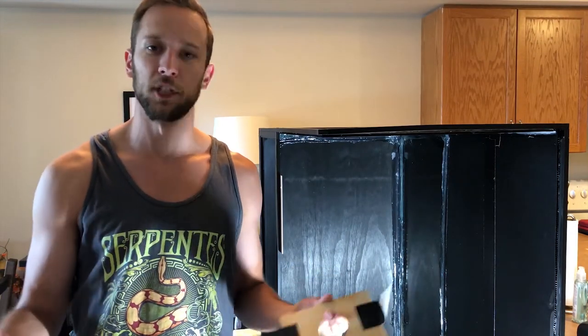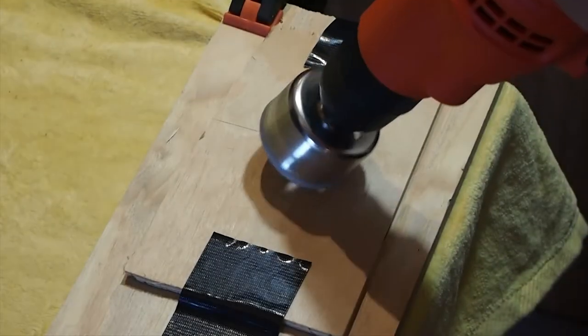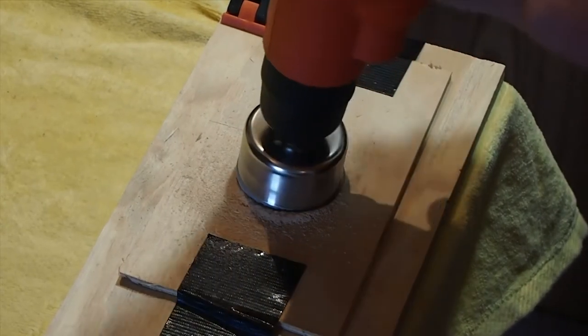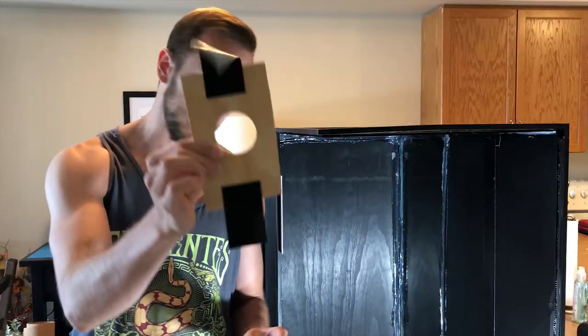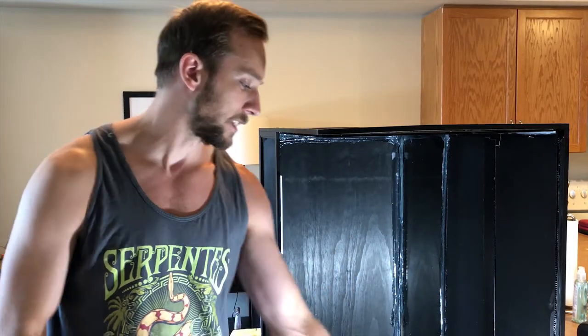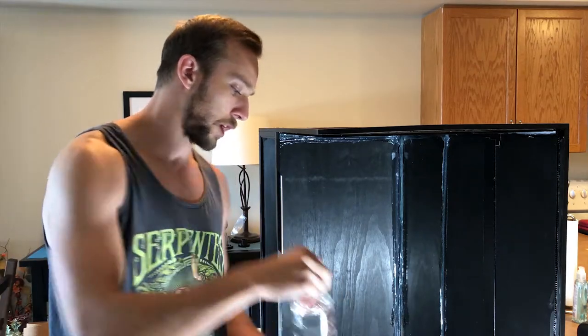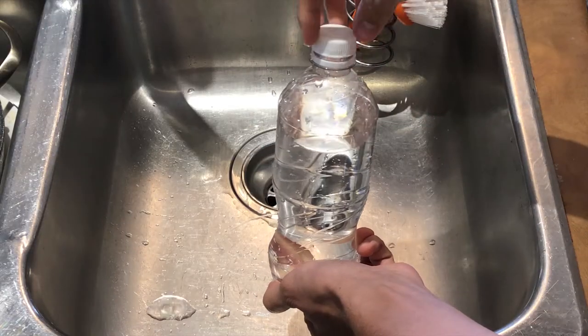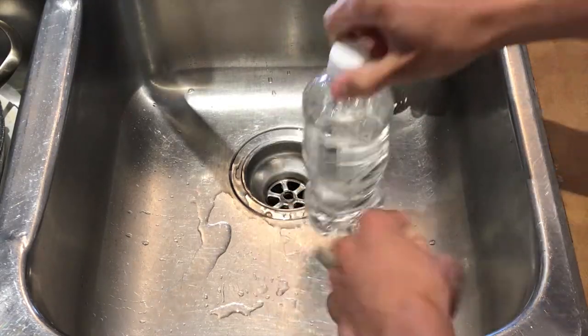Let's try to drill some glass. I found a tutorial video on YouTube from a channel called Chris No Tap — I put the link in the description. As per his instructions, I drilled out a template to guide the bit through the glass and hold it in place. I had to use the diamond bit to cut this, which is a little tricky because the bit wants to move around a lot. I also made a little water bottle the same way Chris does, with a small hole to keep the drill site lubricated and cool.